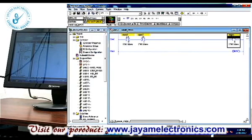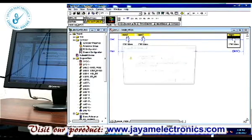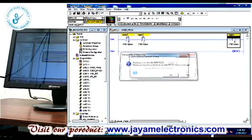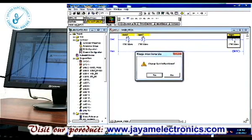Then you will download it. There are no errors, so select Download on the right. Click Download. Click OK. Select Yes. Click the program download. Change back to run mode — select Yes. Do you want to go online? Select Yes.